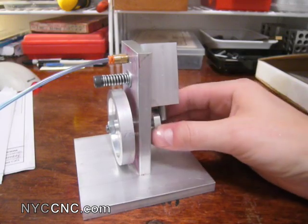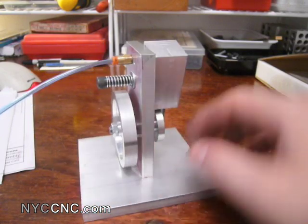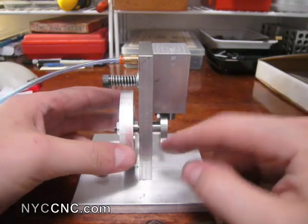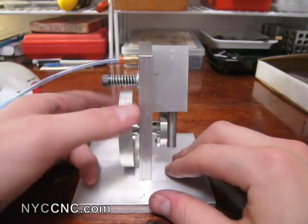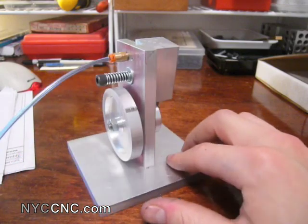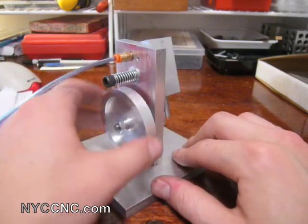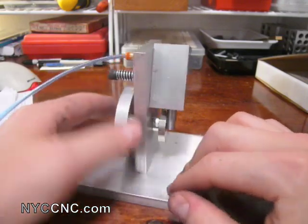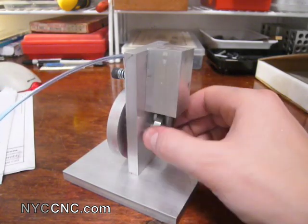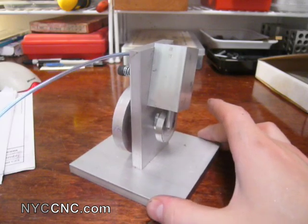You'll notice you have to start it when the piston's in a pressurized position, about like so. As you can see, mine's not perfect. A couple of the problems are I've got a little bit of looseness and gap in this part right here, which is creating a little bit of an imbalance in my flywheel. I also have not cleaned this up at all — I'm really excited to have it finished, but what I want to do now is take a step back, finish up some of the parts a little better and aesthetically turn them. I'll be sure to post an update when I do. But for now it works. One other sign that it's not a perfect engine is that it does vibrate a little bit. I've seen some of these run where they don't need anything — they'll just sit in their spot. Pretty cool though.